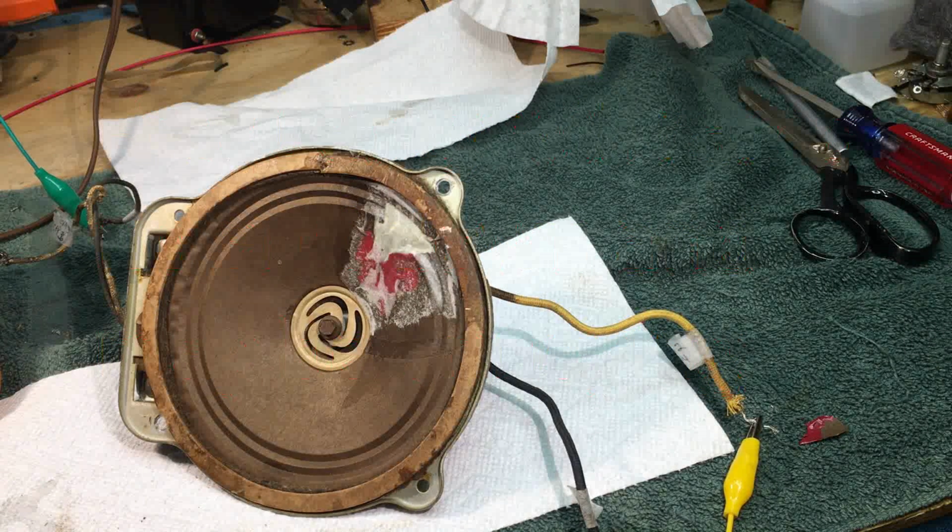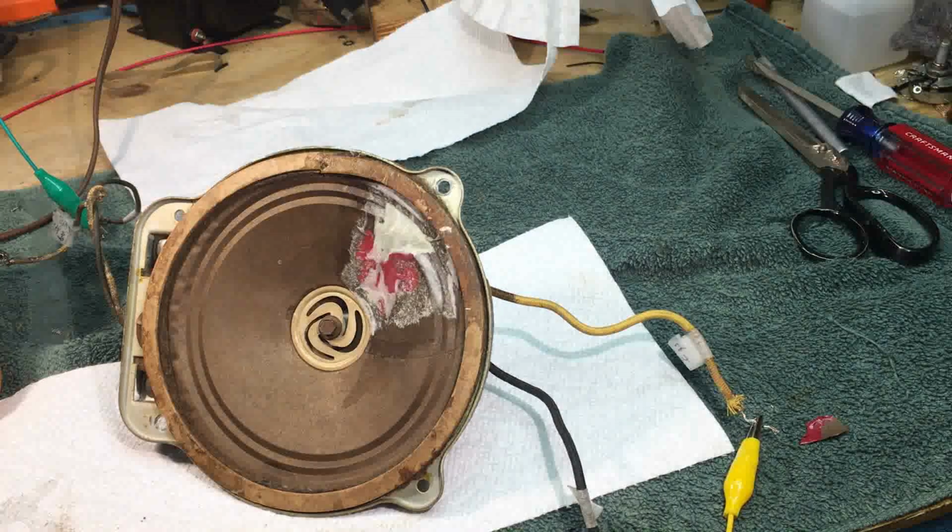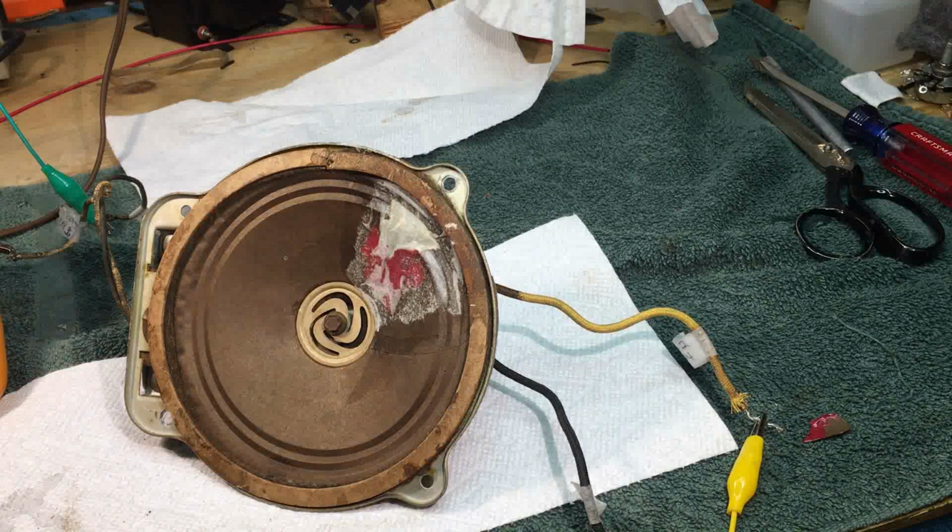It's down about, that was about 200 hertz. Probably can't hear that there. All right, let's bring this up to about 40 milliamps. Yeah, let's see. Okay, well, let's go back to 40 exactly. Right, there's 40 milliamps, and I'm running at 100 and we'll call it 117 volts. Now we can do the math and see what that is.